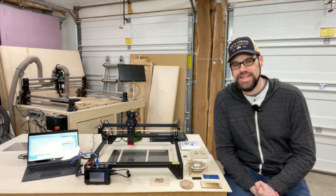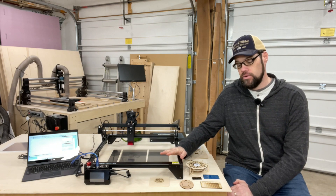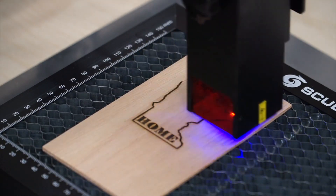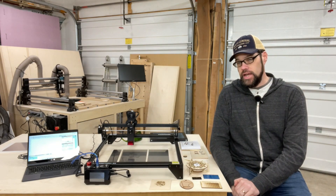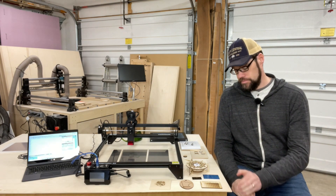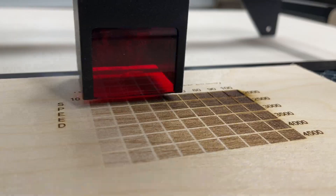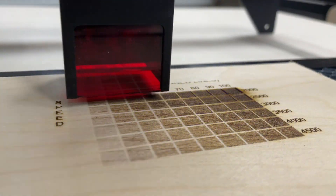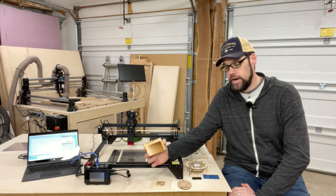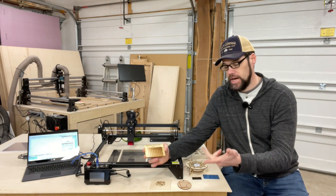The big question is: what can you do with this laser? Diode lasers excel at engraving with detail. This laser has a focus point of 0.08 by 0.1 millimeters, which can achieve fairly fine detail. The best thing you can do is run a raster test for engraving and a speed test for cutting — that takes various combinations of speed and power and puts them into a grid so you can quickly compare shading or how well it cuts at certain speed, power, and pass settings.